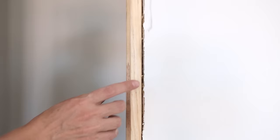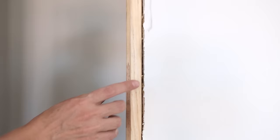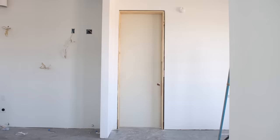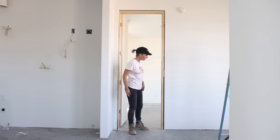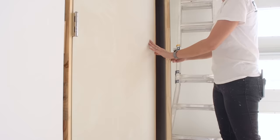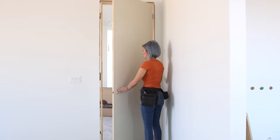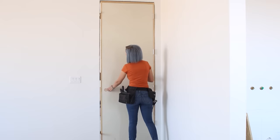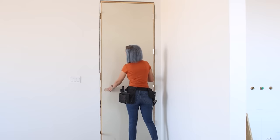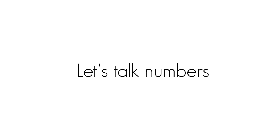The Door Stud will also come in handy down the road when we need to take the door slabs on and off the hinges for painting. Door casing comes next to finish off the raw jambs, but we'll talk more about that in future episodes. The doors will be painted in a high gloss white, and the door casing we chose has a simple but eye-catching design that will bring it all together, making the doors look finished and not too busy.